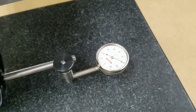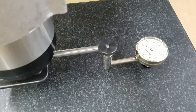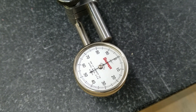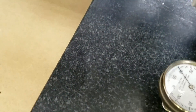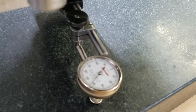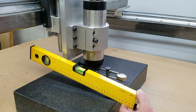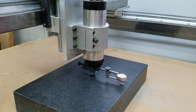The only good thing I can say there is left to right we seem to be spot on; front to back, not so much. Let me choke up on this mounting rod so we can go a full 180 degrees. I've choked things up and lowered the spindle so we have enough stroke. Forward facing we're at zero, and back here we're off by almost 60 thousandths. So what this means, in an exaggerated fashion, is this is the plane the bottom of the cutter is riding in — which is why I'm seeing that little bit of stair step, apparently a little more than I thought. This whole thing is tipped forward, which would go right along with the massive amount of weight hanging off the front.